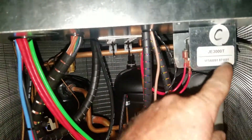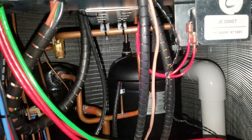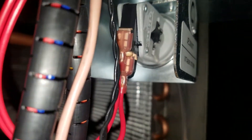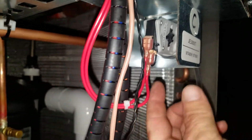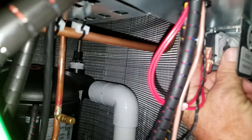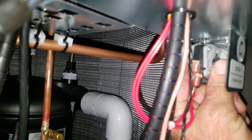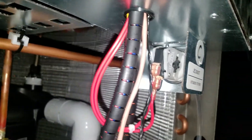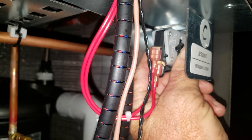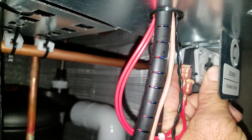That wasn't necessarily true — the pressure switch is right there. There was a thumb wheel that you could adjust, and there's your thumb wheel. You can adjust it, but I tried like crazy to move it clockwise or counterclockwise and couldn't get it to move. There's a button at the very top that you can depress, and once you've depressed that button, you can move this thumb wheel back and forth.